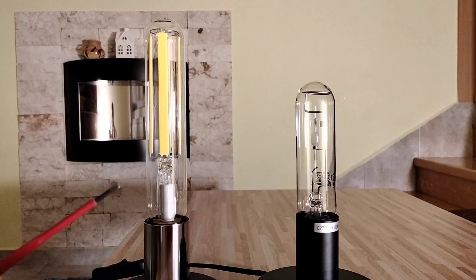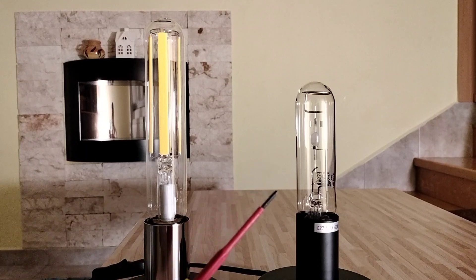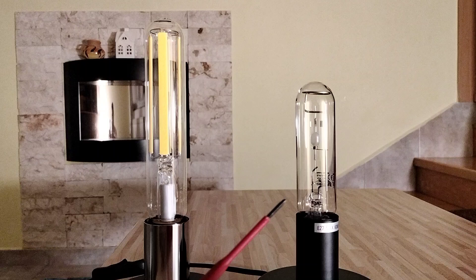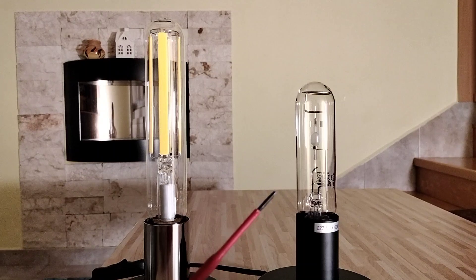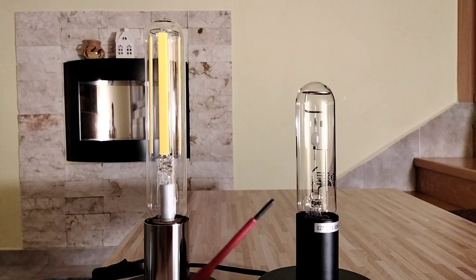For this LED lamp you will need only the mains. But for this metal halide lamp, you will need the conventional control gear or the electronic control gear — I mean the magnetic ballast. And when you want to use the magnetic ballast, you will need the ballast and an external igniter, because in this lamp we don't have any internal igniter. And if you want, you can also use a capacitor.